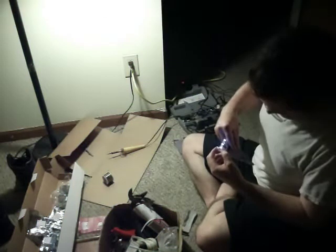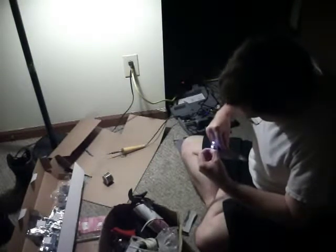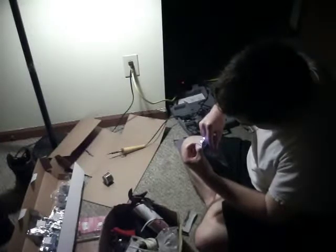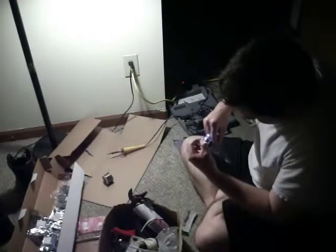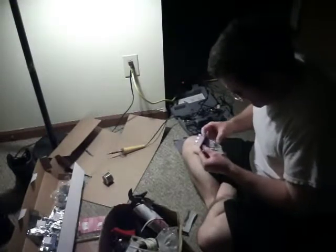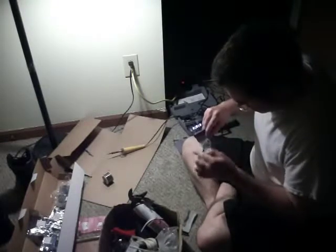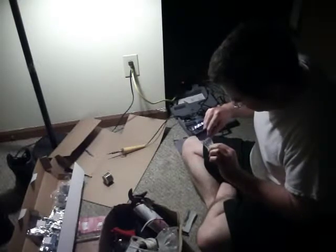You see this LED here, I could take it out of there and plug it into another place and there's no power. You plug it into the next spot over and there is power. What it is, these are divided up. Every odd number pin going across is on one circuit, and that's what operates the odds right here.